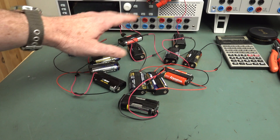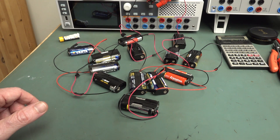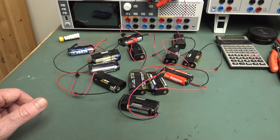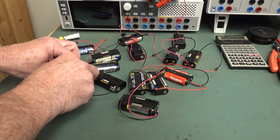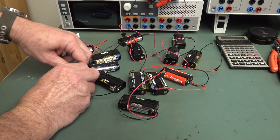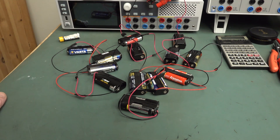I've got two of each different type that I had available. Silly me, I didn't put my thinking cap on in the previous video when I said I'll just use a 10 ohm resistor on each pair and discharge them for like 24 hours. But if you actually do the calculations, you can't just use a 10 ohm quarter watt resistor — you need almost 0.9 watts or something.